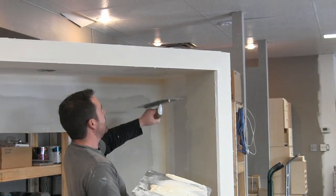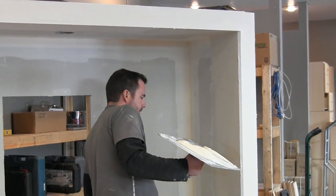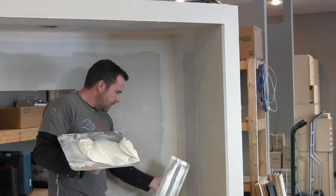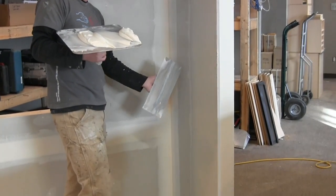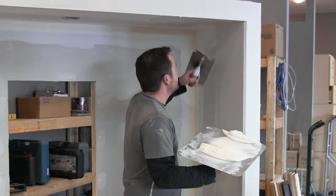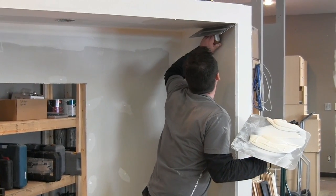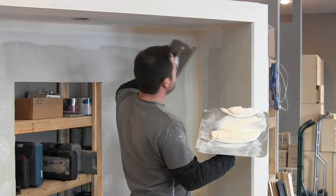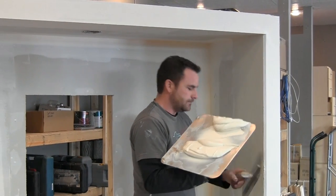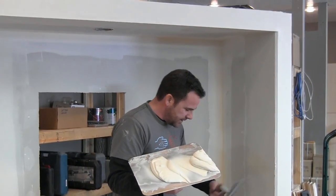I'm far enough away now that I can do both sides and then continue from this point on, so it's all blended out along the left side. I know I don't have any extra buildup — I put enough down but still feathering. I'm going to do that lightly one more time and wipe it off on my pad so I can get a nice, straight clean edge there.